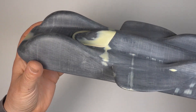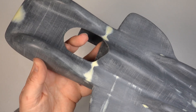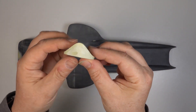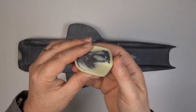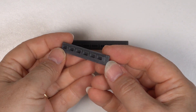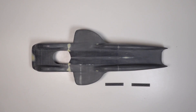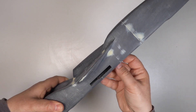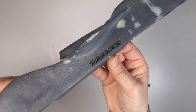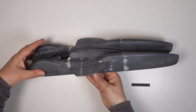I decided that vacuum forming was the best route to take with the cockpit of the T80 and carefully cut out the hole in the bodywork with my Dremel. The part I cut out was then milliputted back into the hole to make sure all the contours matched up, and this blank would be the master from which the vacuum form parts could be made. The exhausts were 3D printed as a strip so they could be installed from behind the bodywork. I decided to go with rectangular exhausts, typical of Daimler-Benz engines of the period. These exhaust strips fitted neatly into slots I carefully marked out and cut into the sides of the bodywork — they'll add a nice bit of detail to the super streamlined shape of the T80. I may drill them right out, which I think will look pretty cool.